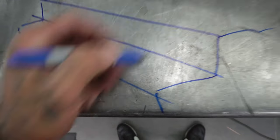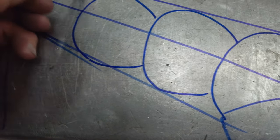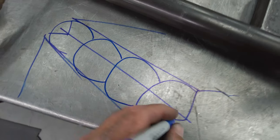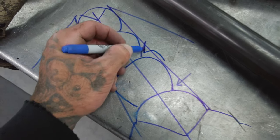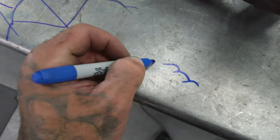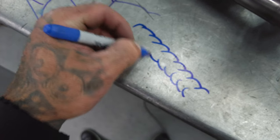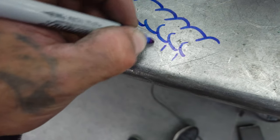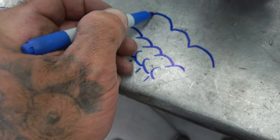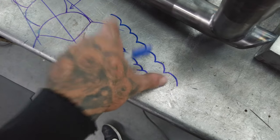Right, that's essentially your fillet weld. And when you're stacking a big stack, this is very exaggerated, you guys, but that's your puddle each time. This inconsistency where it goes in and leaves this edge, even if you make it smaller, all of these little areas are pockets where you've made a very serrated edge of contact between the parent material, each piece.